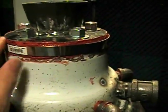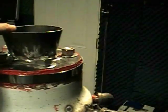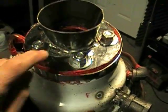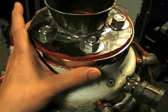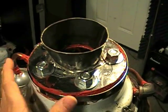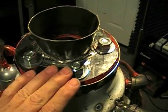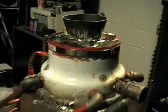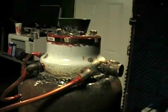I've got a steel band around that. On top of it is my inverted bell, and I took advantage of the setup on this guy here as far as where the lugs went — this is how I put the bell on and how I put the concrete ring on. This also allows me, if I need to make any changes or repairs, to take these guys off. If I want to change this out or extend the burn zone, I can do anything from this point right here. I was thinking about it as if it was a Rolls-Royce engine — I wanted it to be serviceable.